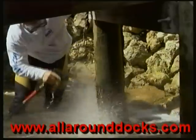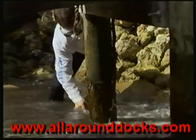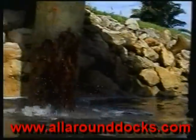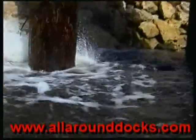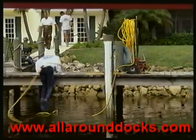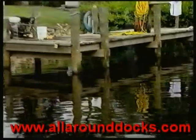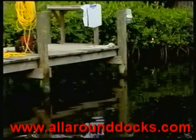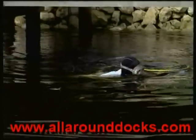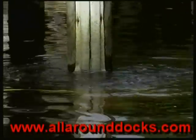We tried to coordinate this portion of the dock restoration with one of the two low tides we receive daily down here on the east coast of southern Florida, which is going to give us much better access visually to the piling to see exactly what's going on underneath. We have a total of six pilings driven into shallower waters on the river bay, plus an additional four pilings placed into deeper waters so a boat will have plenty of room to accommodate draft when tied up. By using dive masks, it's underwater for these guys, and because of the pressure from the pressure washer, any crustaceans found will be removed within just a few minutes.